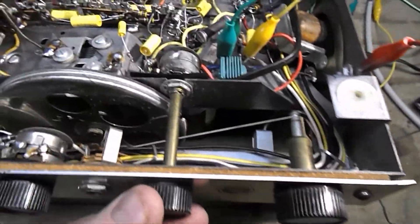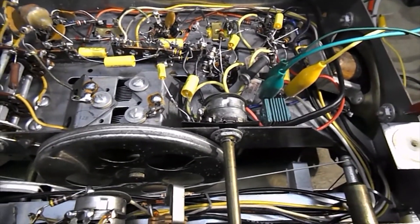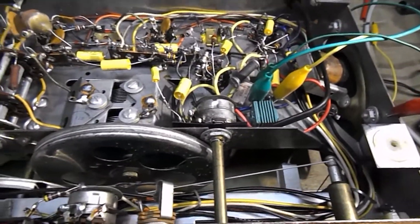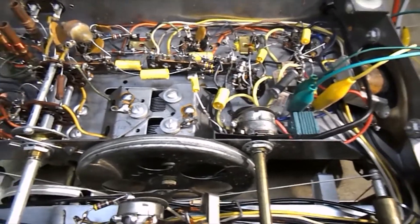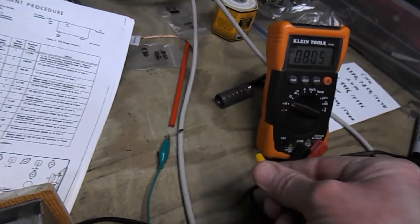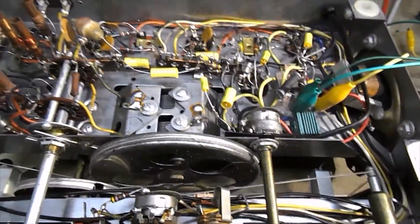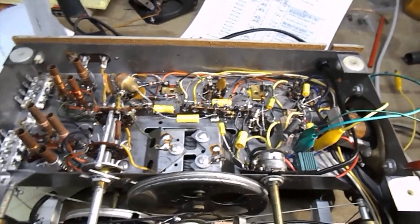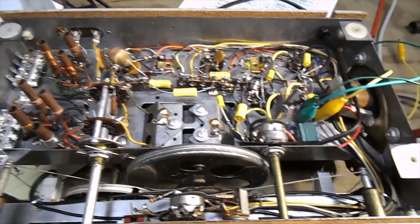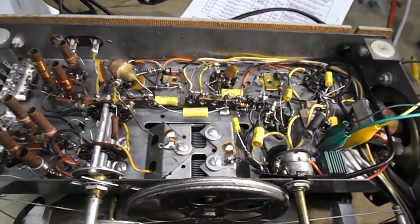Taking it out of standby — right now it's on band 4 at 13,600, picking up all kinds of stuff including a little CB channel 6, also known as the Super Bowl. I'll disconnect the diode — you can hear it gets a little quieter and the volume went down a bit, then it picks up a little. Putting it back in standby: this definitely helped. The voltage is right where I want it at 142, and the schematic says 150 is good — I'll call this close enough. I'll solder that on and continue.